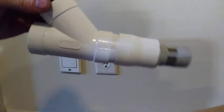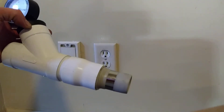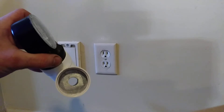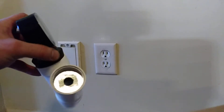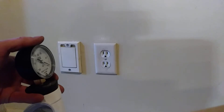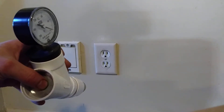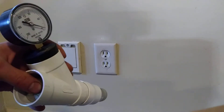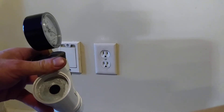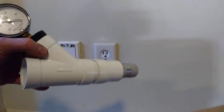The other part is this Y fitting, made by HP VacuFlow. It's a Y adapted down to fit into the wall inlet, and on the other side of the Y there is a steel plate precisely drilled with a 5/8 inch orifice. This is tremendously more useful than the vacuum gauge by itself because it allows you to take two types of measurements: one with the hole blocked off and no air flowing, called sealed vacuum, and the other with the hole uncovered, called working vacuum, which shows how much pressure remains with air flowing.